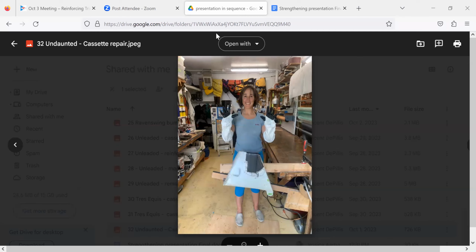But over 8 years, I think by the fourth time he finally fixed it for me, he was like, you're all for me. But he underestimated the load on that rudder, because we snapped the rudder off right at the bottom of the cassette. When I threw the head stock on the deck, everyone who knew anything about multihulls said that guy didn't know what the hell he was doing. There's not enough carbon in there. He had twice as much. And then once I got the board rebuilt, it started tearing apart the cassette. It was splitting the cassette on both ends. And then eventually we were coming home, and it was opening up big time. So we pulled the rudder up about a foot.